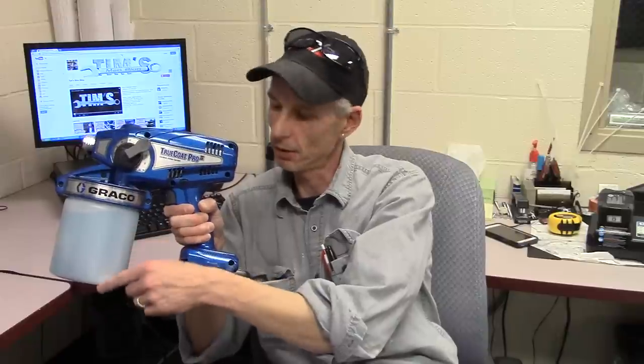If you're looking to save a lot of time and put on a nice even finish, it's well worth the money. If you need something that's going to spray a whole bunch of paint, this isn't going to do it for you unless you want to stop and let your batteries charge. With the water-based paint I was using, it's about one cup full — about a quart of paint per battery — so about five to ten minutes trigger time and your battery's done.